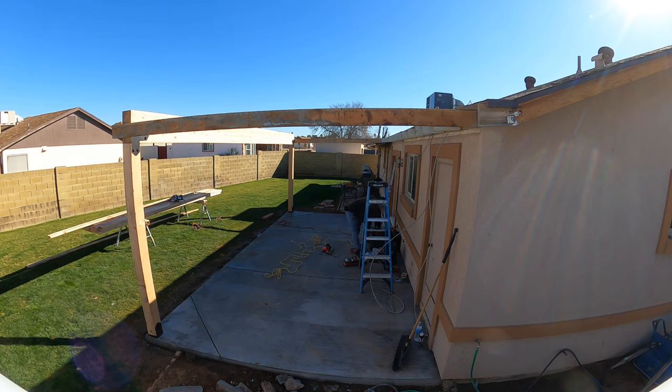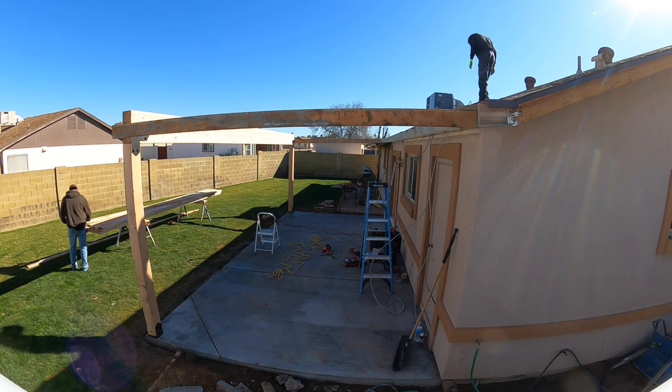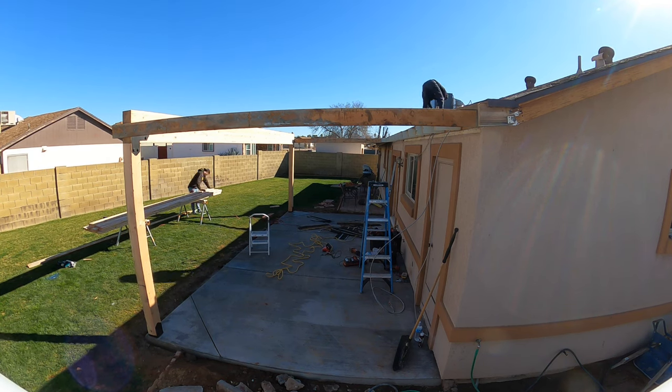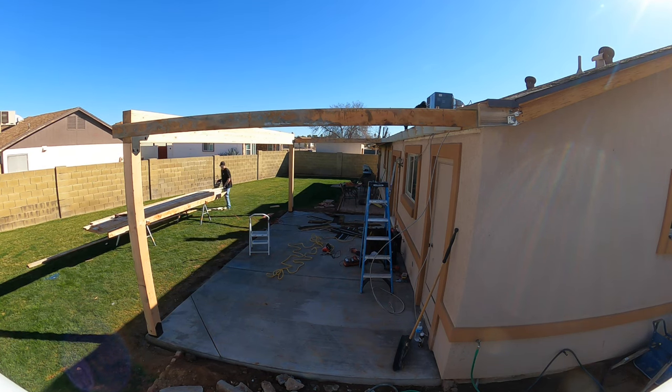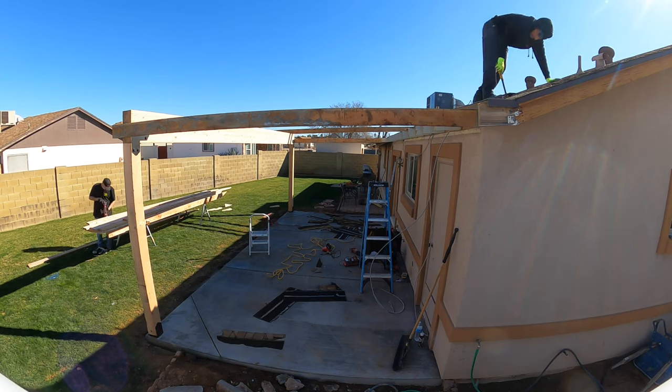I did this project a long time ago, but if I were to look at it right now, I would say that's a five and a half by 12, probably by 26 feet beam. Once we get it up, we brace it with our form board — that's not the board we use, it just holds it into place as a safety thing. Look at those brackets on the post: post-to-base and post-to-beam. It looks really good.